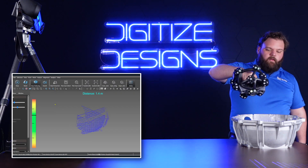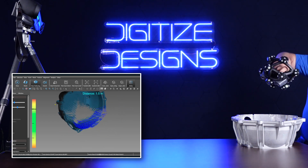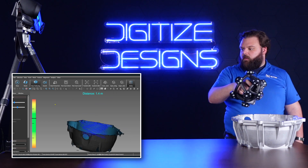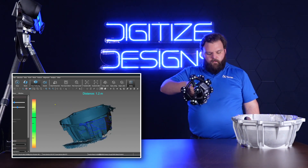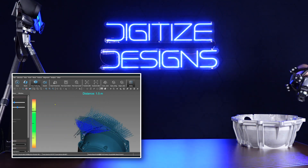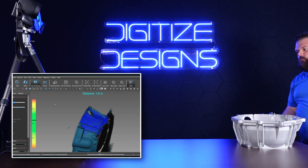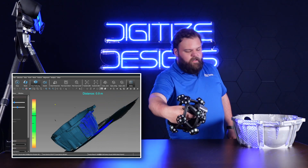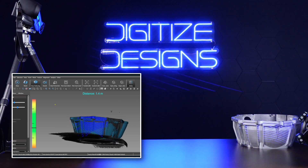We'll do a new scan with the same settings, put the part over, and click start scanning. I just want to fill in everything — mainly the stuff I missed on the last scan because it was hidden — and then capture enough geometry in common with the first scan to use for alignment. The inside portion is what we missed last time, and the outside portion is what we'll use for alignment. Anytime it pauses, it's usually because the tracker loses sight of the scanner for a moment — it just pauses so it doesn't collect any bad data, then picks back up as soon as visibility is restored.